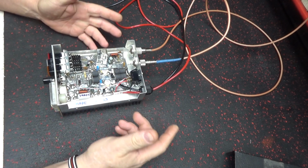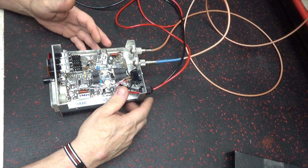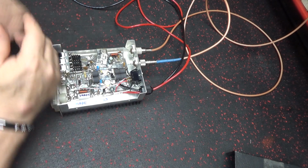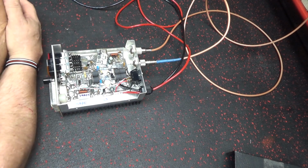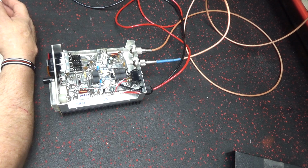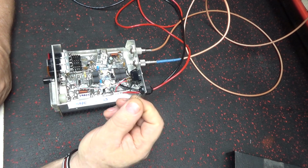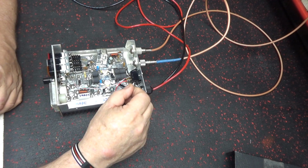Alright, I got a couple hours in on this plus a little cleaning. So, it did hit me for a bit of a loop. I don't know why it done that. Even with this transistor, it was keying and unkeying, but it was oscillating. But I changed that transistor out and it quit oscillating. Go figure.